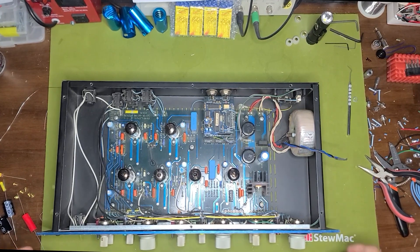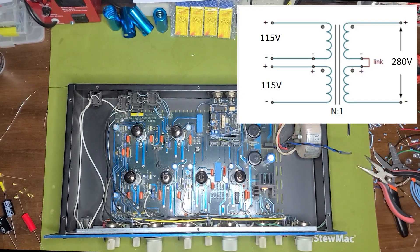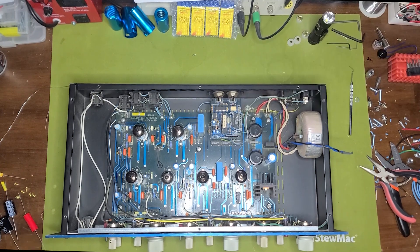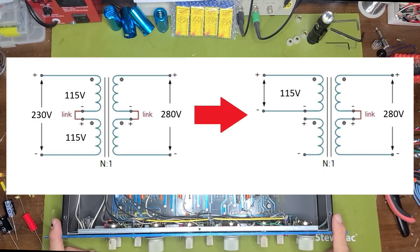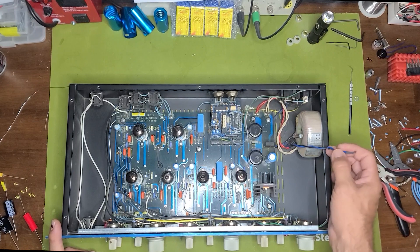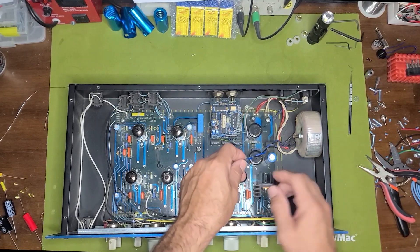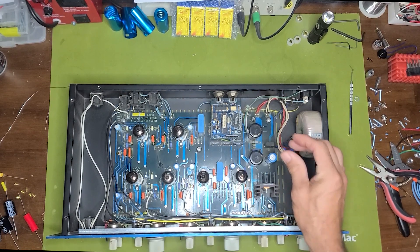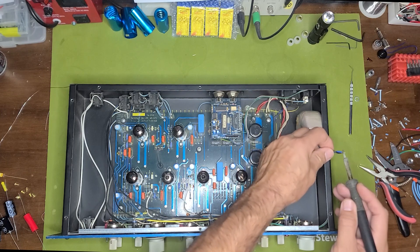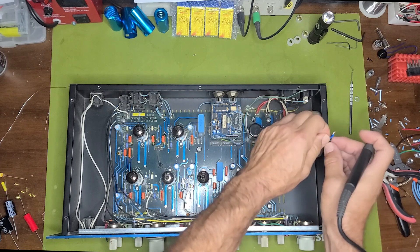All right, we've got the Brunetti on the bench and we're going to do a voltage conversion. So if you read the transformer, you've got two different 115-volt taps which you wire in series to make 230 volts. This is a 230-volt preamp I got in Europe and brought over. To convert it to 115, I just need a single one of the two primary taps — black and blue pair, each one is 115. If you tie the black to the blue of the next pair together, you stack those two and create a 230-volt tap. I'm going to reverse that and make this a 115-volt tap — separate those two and bring them back.